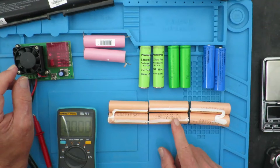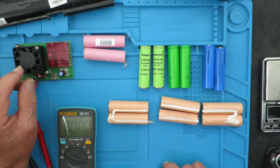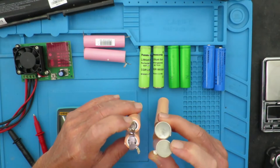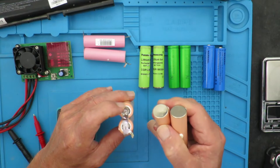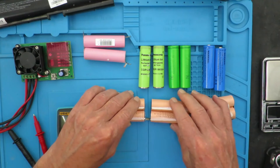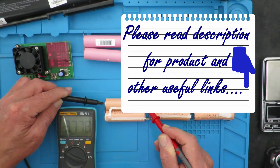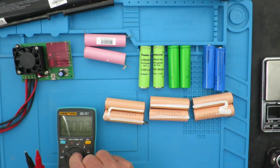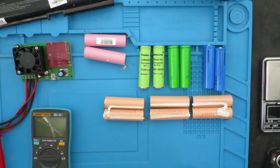In this particular pack when I took it apart, it was fairly obvious why it had failed — it failed because of poor spot welding. Indeed, this cell here is dented, so it was damaged during fabrication of this battery. That is why it was thrown out. But if we check the voltages: 3.7, 3.7, 3.7, 3.7 — there's nothing wrong with the individual cells. It was just a fault in the construction, so they will be well worth recovering.